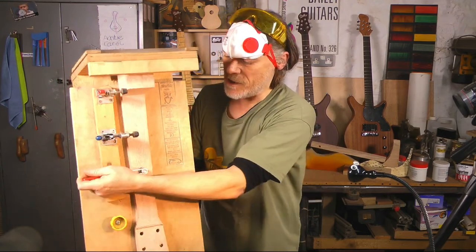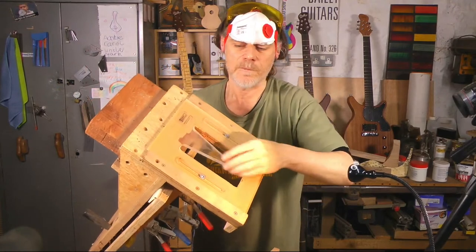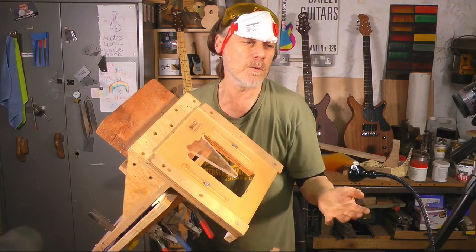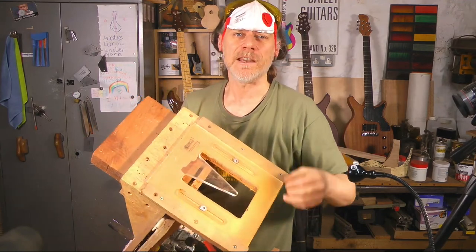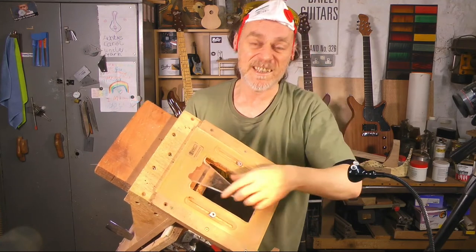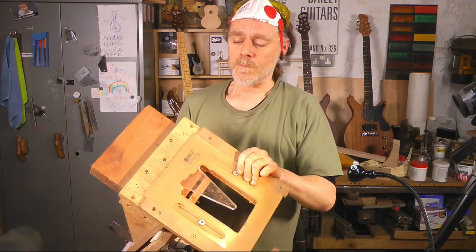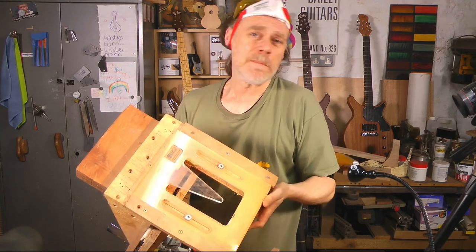And the important part of this jig, if I just take that neck off from it, is obviously it's got the place on the end again for the reverse of the previous one. So this is the tenon version. Again, I've bought these from Stuart McDonald, but you can make your own. I used to make all my own, but there comes a point where, because I haven't got my own CNC machine and I'm doing everything by hand, it's easier just to buy something like this. I have got a stack of different versions of dovetails, because it doesn't have to be angled, it can be just straight, you see, because it's still dovetailed. There's different versions with different angles and shapes.